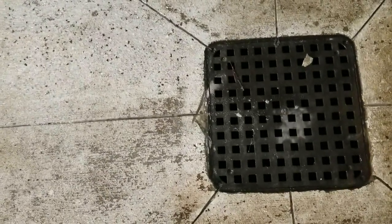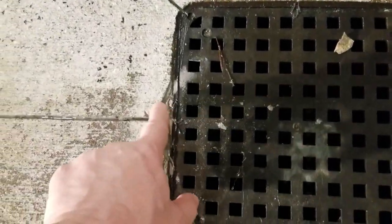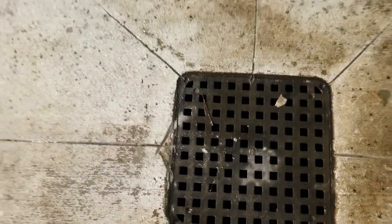So I think that is great. I had to extend this line further up because there's a low spot in the floor right here. I switched to my phone camera because my GoPro was giving me a hassle. I extended the grind in the cement by about three feet, and now the water is flowing through that little trough and making it to the drain. There was a high spot right there so I chipped out a bit of the cement there.